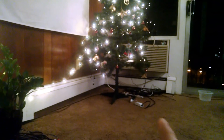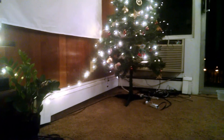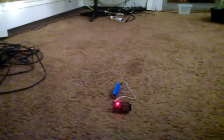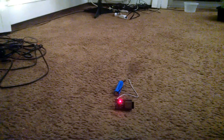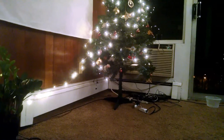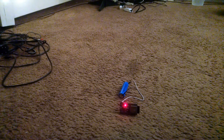So the Sonoff device, which is just the cheap base model, is running that firmware pretty much completely unmodified. And this device here is running a slightly modified version of their MQTT firmware, which basically just posts the correct message — like GPIO with the correct pin and toggling the state. Just a JSON message that tells the other device to turn on and off.